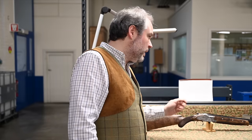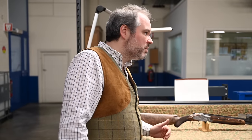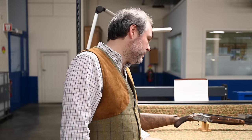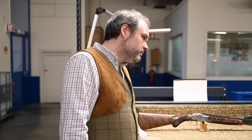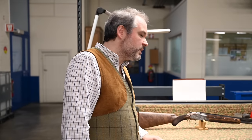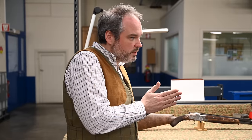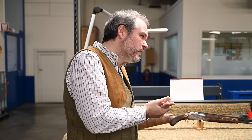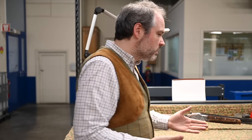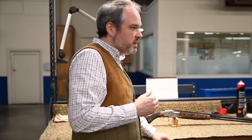Okay. And once Bernard stamps the certificate, it means it has reached at minimum 100% of the Browning specification. So the shooting test is just to check the barrels converge in the right place and the pattern is good? Yes. But now, in fact, everything is done when they assemble the tubes. So we know it's good. We never had any issue, but if we did, we could rework a little bit on the choke zone to change a little bit the convergency.